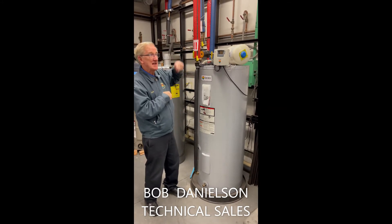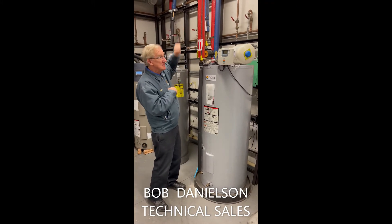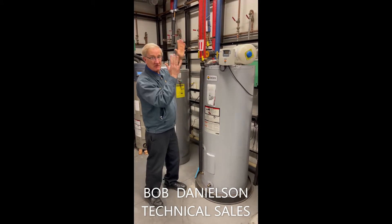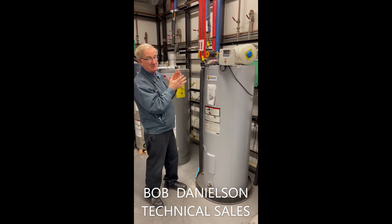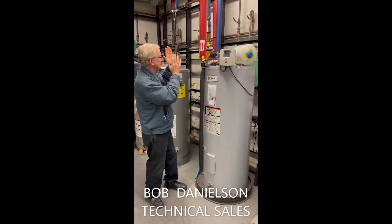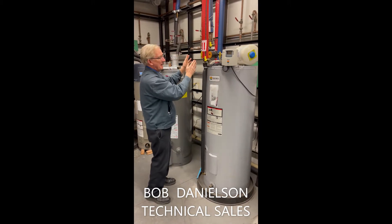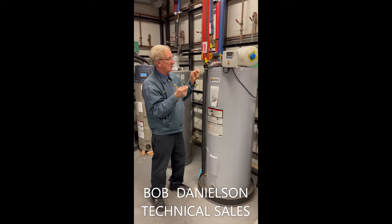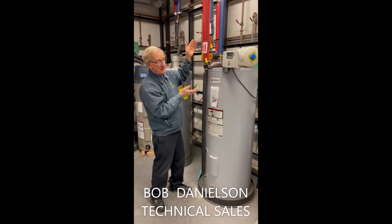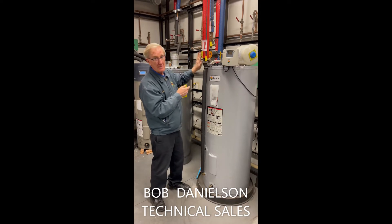It's like having two light switches. You have the main breaker that needs to be on at the main service panel — if you don't know where that is, you may need a technician or electrician. And then the little gray box is usually on the wall next to the solar tank. Two things: the main breaker is on, and the little gray box is on.